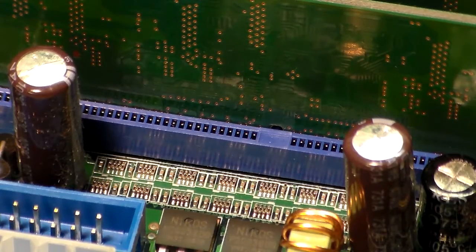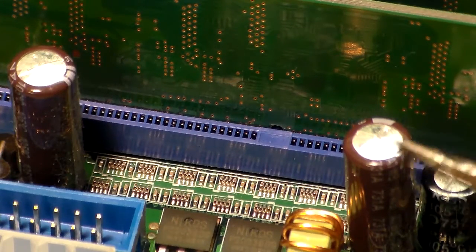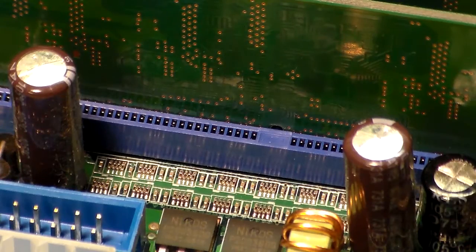So that's a total of nine capacitors that we need to replace, in hopes that we can get this motherboard up and running again. The unfortunate thing about these pre-built computers is they just use cheap parts on their electronics and you don't get the performance and reliability that you do with custom-built stuff. So what we're going to do is try to revive this motherboard. I've got some replacements here — all nine capacitors are 6.3 volt 1800 microfarad. We'll go ahead and desolder all of them and install new ones.